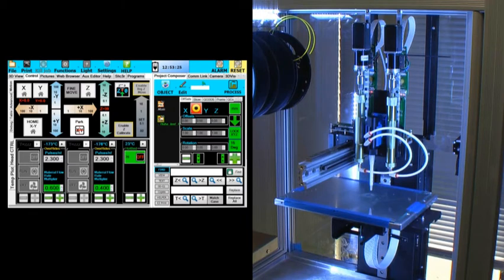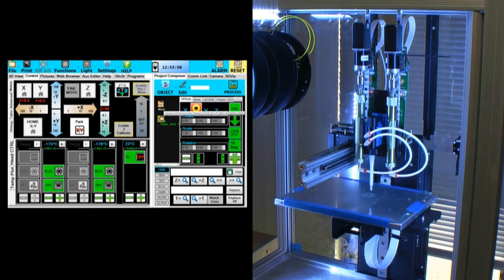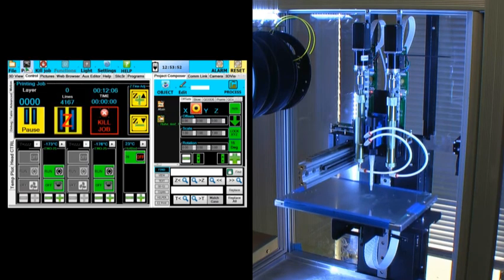If you want to see that, we can look at our Comlinks tab and look at our transmit button. If I change this ratio, it sends an M911, which means it's an emergency command, and it goes to the top of the queue. It doesn't wait in the print buffer, and it changes my S value for M221 on this head to 0.65, and I can set it back down to 0.60. All right. With that done, to start a print, we would just have our G-code loaded. Here we do, and click print.